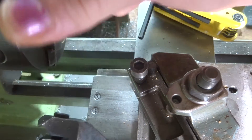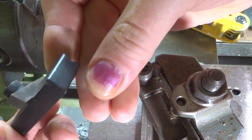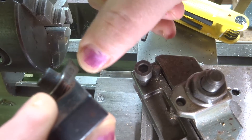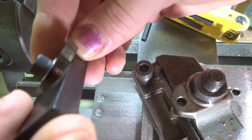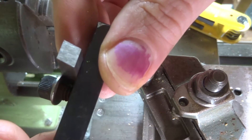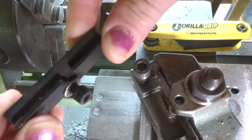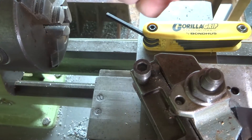So I thought I'd give you a bit of a closer look. I've taken it apart and cleaned it up. It comes with these bits. This is a sharpening jig — it's just a slot in a piece of plate with a bolt to hold it in place, and it's used to get the right angle and the right shape against the bench grinder. You can see a bit of a curve there, and that just sits on the bench grinder plate. You get a fairly nice finish just moving it backwards and forwards — a nice sharp corner. That makes it very easy to get a sharp tool at the right height and at the right angles.